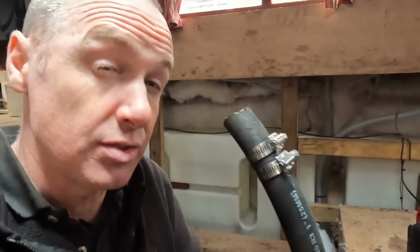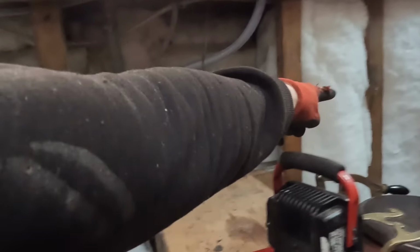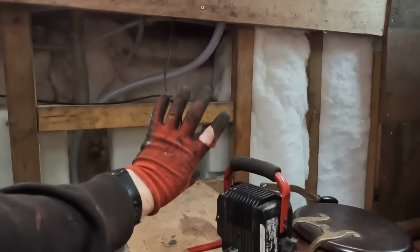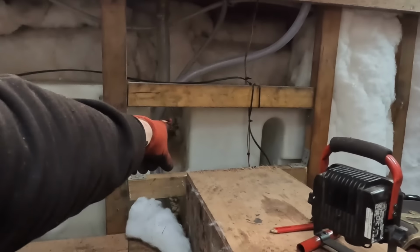There is my outlet, and I need to put this hose on the outlet, and this is the sink waste. It needs to curve around the corner, go through the wood, and then pop out where there will be a sink somewhere about there. So before I pack in that place with insulation, I need to have that connected.